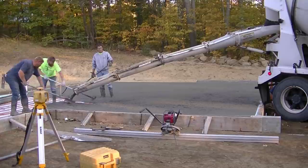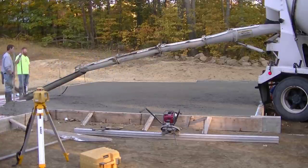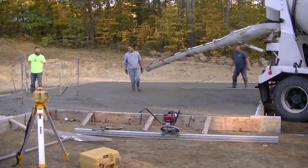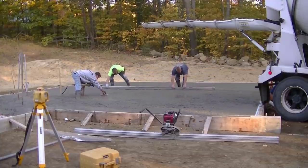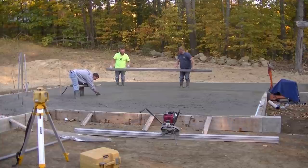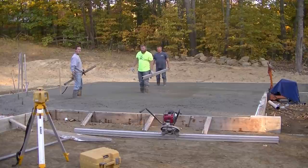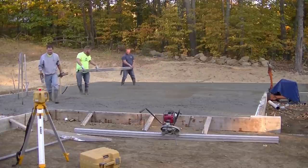This section right here is about a 30 by 30 foot section, so that's going to pretty much take up that one truck. He's going to empty out right there, then we'll get the second truck out back. We like to empty out that first truck and get it right back to the batch plant. This is also about 6:30 in the morning - we always start early. We want to get our trucks right back to back to back. You can see Darren and Luke striking our wet pads, based off the pads I make.